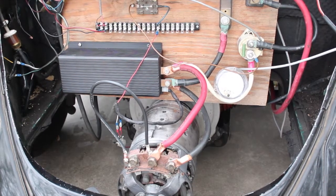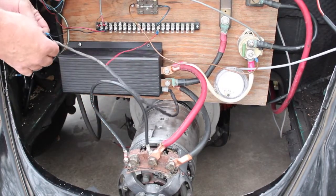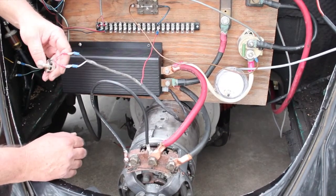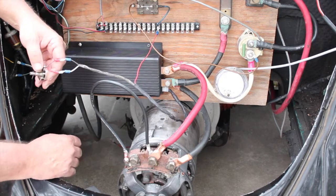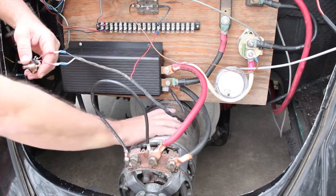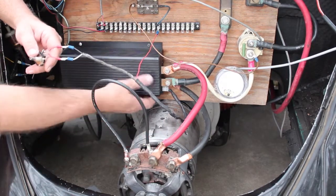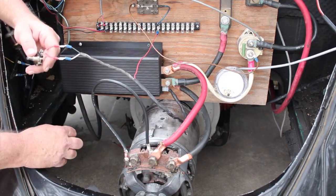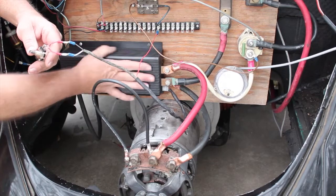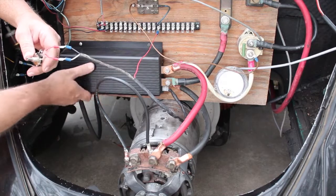Contactor on. The motor has got a little clunk in it — it is an alignment issue or flywheel balance issue that I'm going to deal with, but we're just making sure the motor runs without getting hot. Last time I ran this, the motor got pretty hot — actually quite hot — and the bottom side of the controller was just scorching hot. Now I've been playing with this for quite a while and it hasn't gotten hot at all. Motor's warm, controller's not even warm.